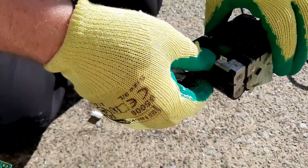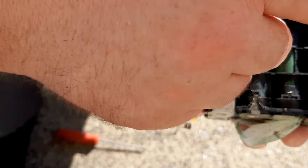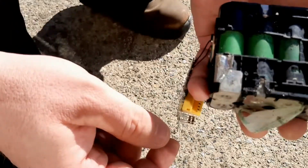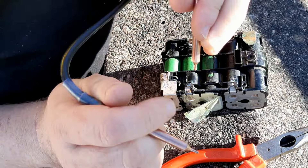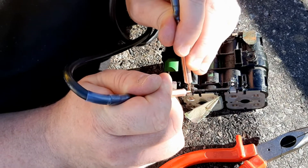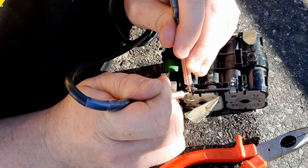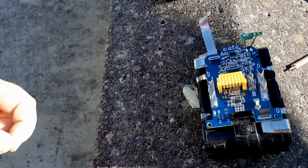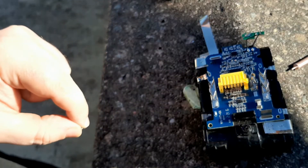We remove this part of the board here. I have damaged two of these connections taking them off, so I'm going to have to branch in a little bit of nickel strip into both of them — I'll probably need to spot weld a couple of bits of nickel strip onto them to make it work. I've cut a little bit of nickel strip and I'm going to tack that on and spot weld it. This has turned into a larger task than I thought. I've had to do a bit of spot welding here and there, and I have one more joint to just connect, and then it'll be time to re-solder everything.